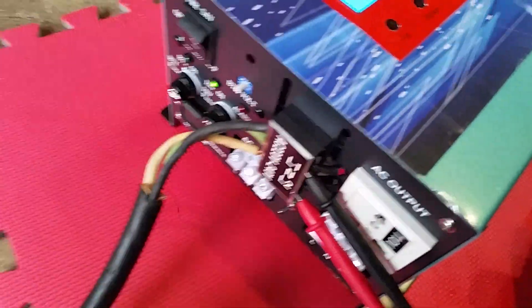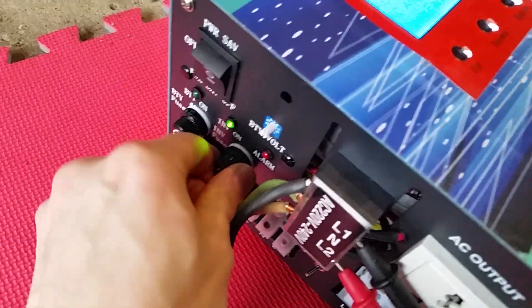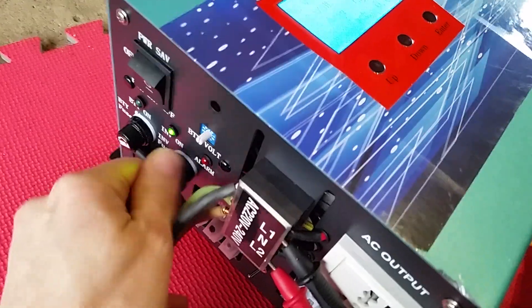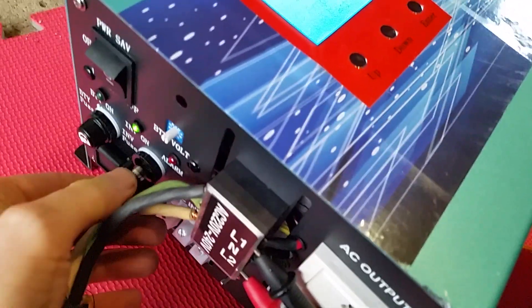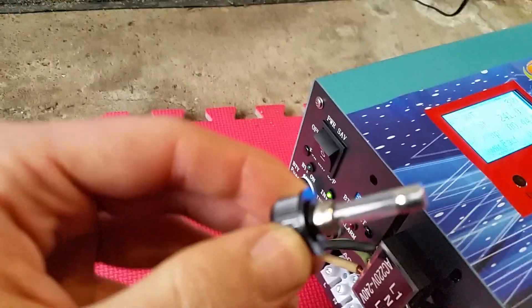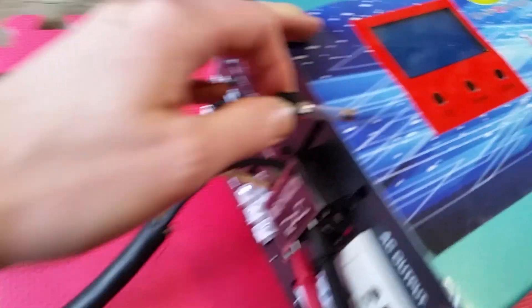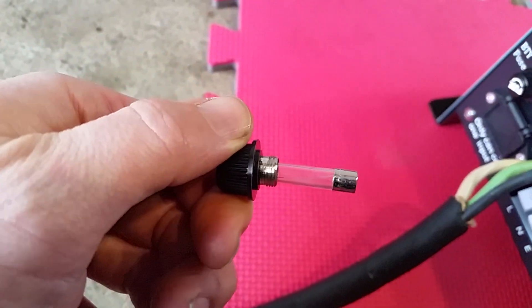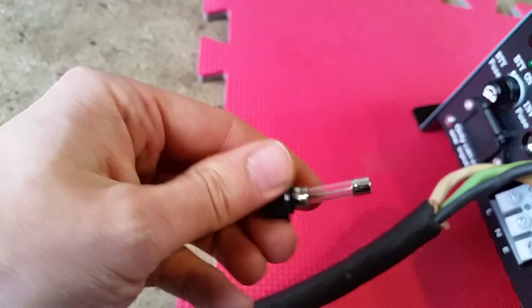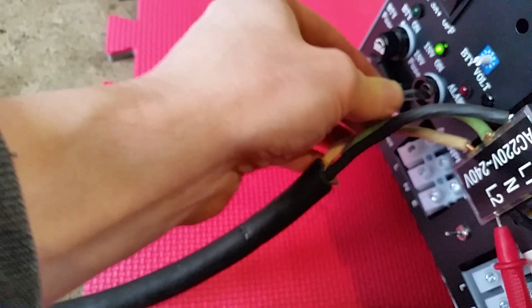What happens if I take that fuse out? I've got a battery fuse and an inverter fuse. The battery fuse I'm pretty sure is just for charging the batteries. The fan's on. The fuse is melted — I don't know if I can get that on camera. It's not blown, but let's see how it's sagging down like that. It's pretty toasty. That's essentially exactly what I expected.